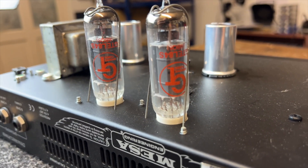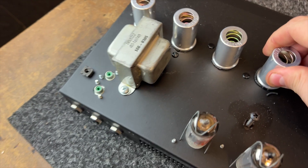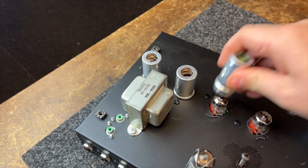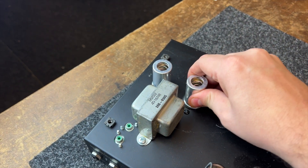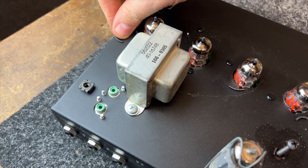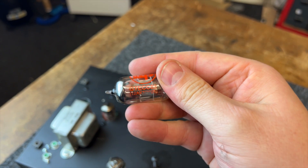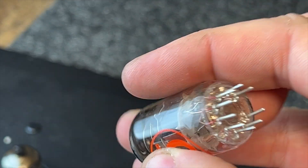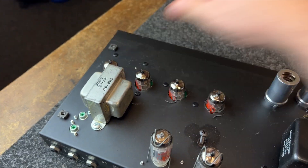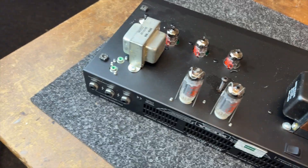It's got a set of groove tubes. I don't really like these clip shields — the rubber is just falling apart. This doesn't look blown to me. I'll go through and check the others, but I don't think this is a valve problem. I do need to have a look online to see if I can find a schematic for this circuit, because without it, I'm kind of flying blind. How on earth do you work on that without a schematic?